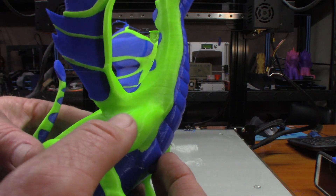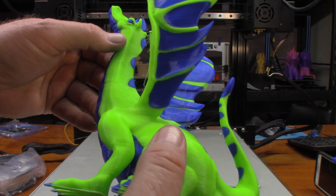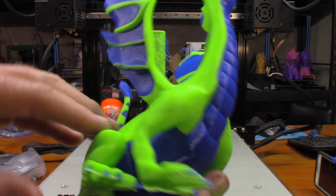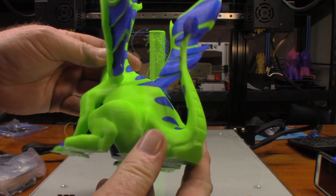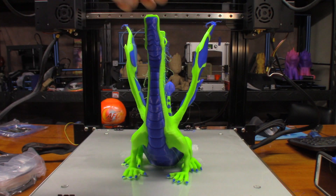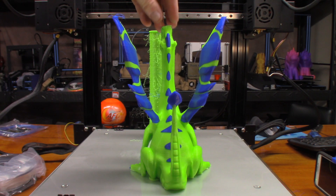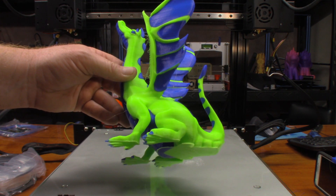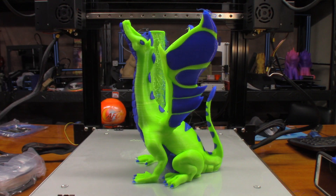Layer line wise, this looks really nice — one of the nicest printers I've ever printed with. With that said, I'm actually seeing more shifting on this side than on the other side. The glass moved over a good eighth of an inch during the duration of this print, so I have no doubts that's what caused some of these issues. I'm definitely going to revisit it and try a new profile. But for two-color prints, that's really clean — having the two different colors without worrying about mixing really turned out nice. Anyway, thanks for watching, have a great day, take care, and I'll catch you in the next one.